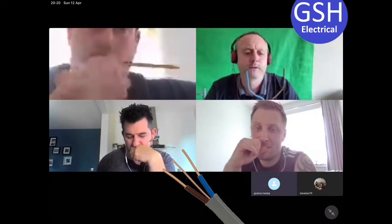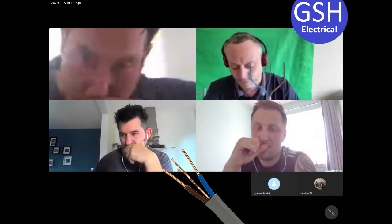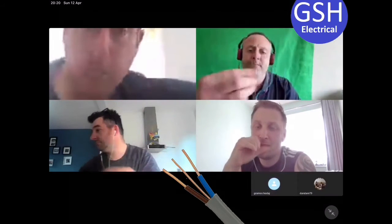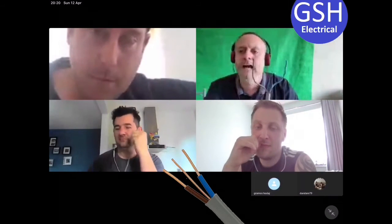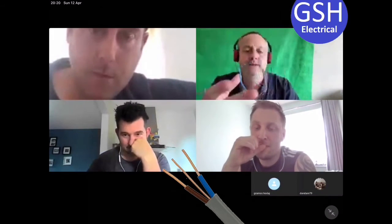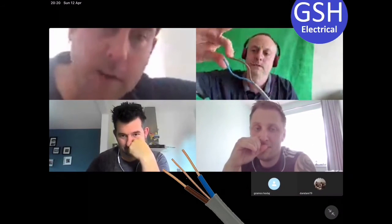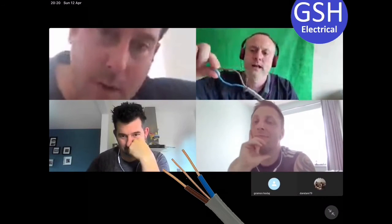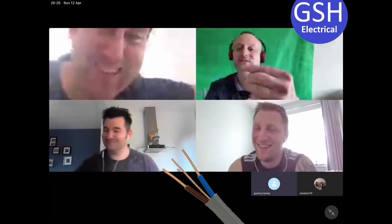Let's go with Gramos. You still there? Yeah. The blue conductor, name it for me. Neutral. And the brown conductor? Line. Good. And the bare conductor in the centre we call? CPC. Good. And John, what do we describe the brown and blue conductors together as? Line conductors. I didn't quite hear you. Say it again, John. Yeah. So we describe those as live conductors.